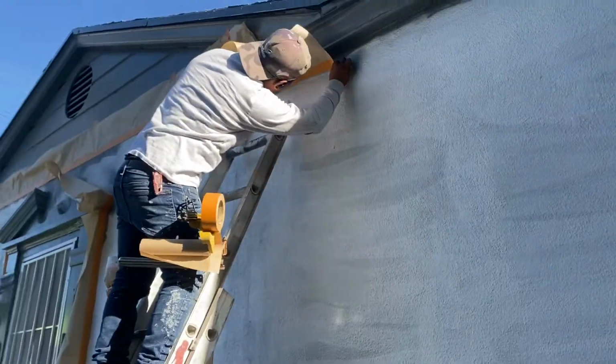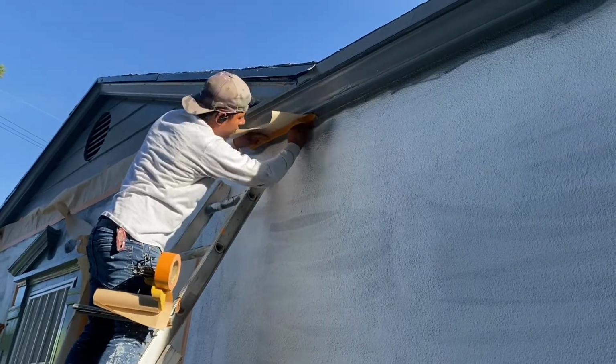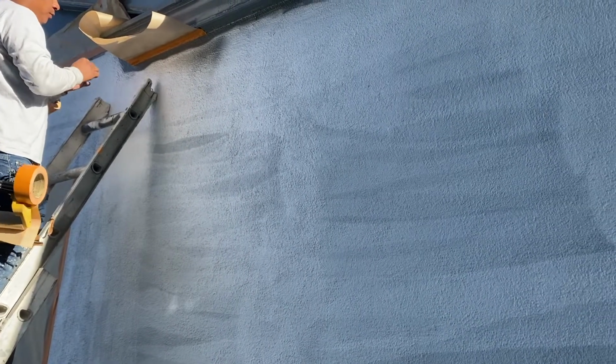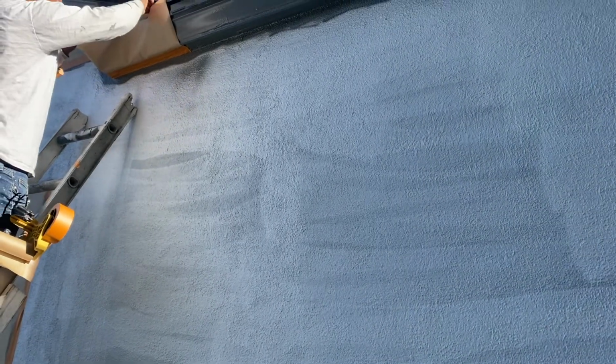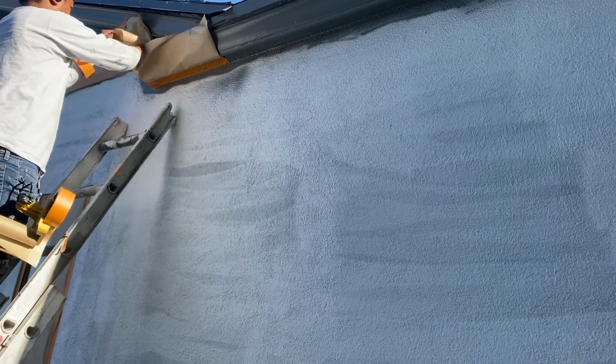Hey guys, here's some masking tips. Not all masking tape have the same stickiness level. Use extra sticky tape on uneven surfaces like the exterior walls and trim of this building. And use less sticky tape for more smooth, delicate surfaces like interior walls and glass.